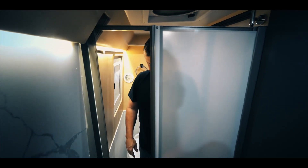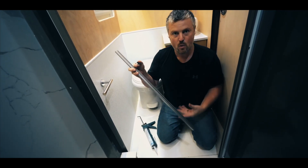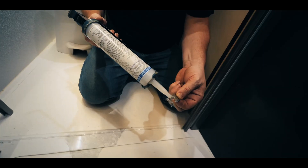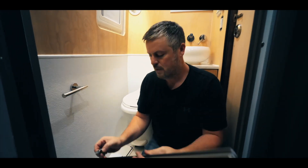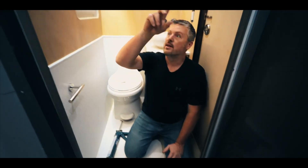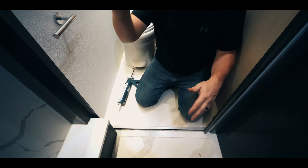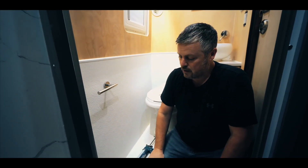Let's give this a test — just for our top track, and it clips in like that. The next step is putting in my bottom rail. I want to do a good job sealing everything before I put this in, so I'm going to put a bead of silicone along the bottom here. Water always finds a way — I don't want any chance of water getting around this piece. There we go. Now we're going to clip this in place. The last thing I really have to do is go around the entire perimeter and silicone it all off, and that will also keep it in place. The top and bottom rails are keeping tension on the wall pieces, so they really shouldn't go anywhere. Let's give this door a try.